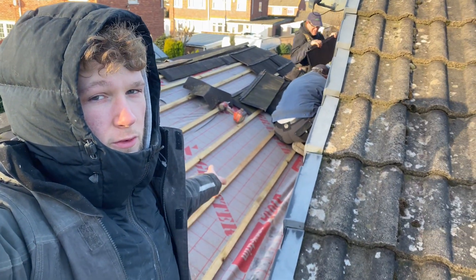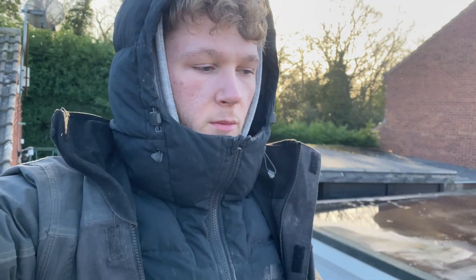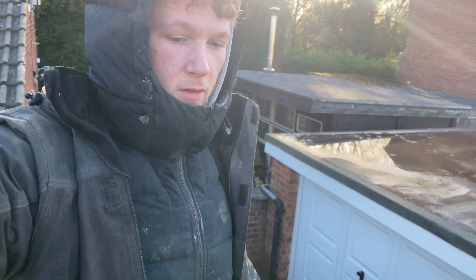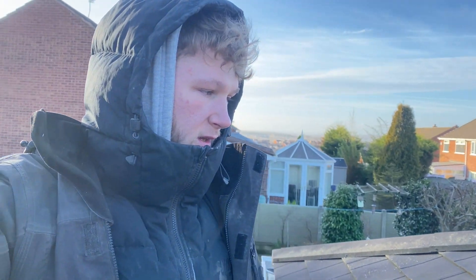So they've got the roof stripped off now, just to have a look and see if there's any splits or anything in this part of the roof. But we've also realized, when we take these off - because they're a metal tile, not your usual concrete tile - there's a lot of condensation underneath them, a lot more than you'd think. So we're going to keep investigating and see what we can find.